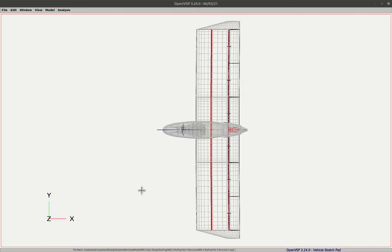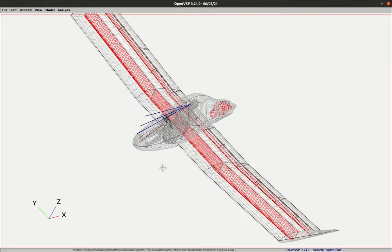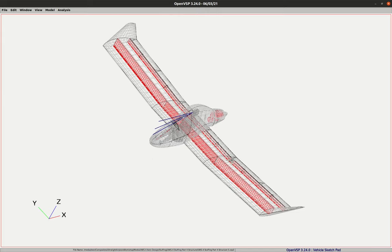Here's a top view of our fuselage and wing. This red line is our main spar. This area back here — roughly the hinge location for our flaps and ailerons — will be the rear spar. This is the center section. Both the main spar and rear spar will be bending beam through the fuselage here in the center section. Out on the outer section, I probably will not do bending beam for the rear spar — I don't think it's necessary. The rear spar will only be designed to handle shear force, not bending. Bending will be handled entirely by the main spar on the outer panels.